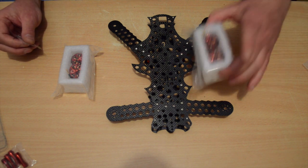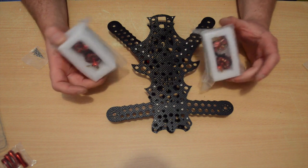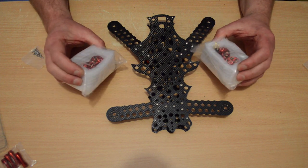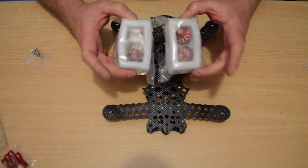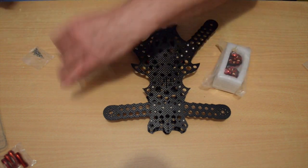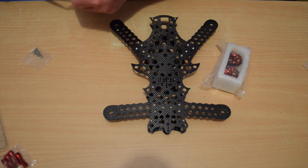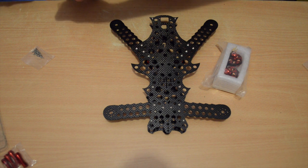There is a subtle difference with the reds. You notice they come packed as pairs because there's a left and a right motor, or a clockwise and a counterclockwise motor, and there's actually nothing different wound. It's no ooga booga as far as which way it turns. The difference lies in the base of the motor itself.